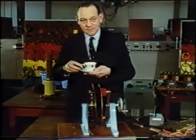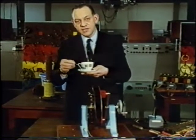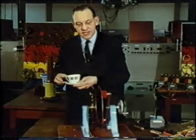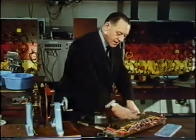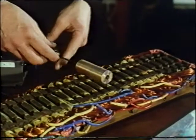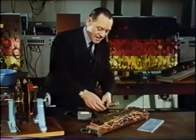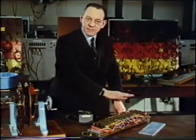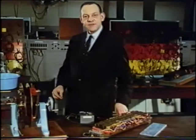Now the engineer needs little more in the way of explanation of an induction motor than this. As long as it reminds him of stirring a cup of tea and continues to give him right answers, he will continue to use it. So for example, he will see his linear induction motor as a magnetic river which is flowing along. And the fact that if I dip the cylinder into the river, you can almost imagine the fluid flowing underneath the cylinder and causing it to spin. So from now on, we're going to think of our linear machine as producing a travelling series of waves of magnetic field, and when we want to design such machines, we need only study the mechanism of mechanical travelling waves.